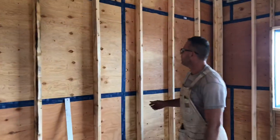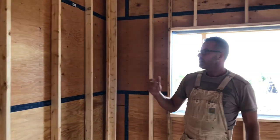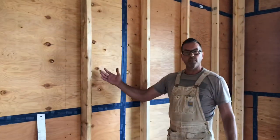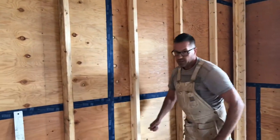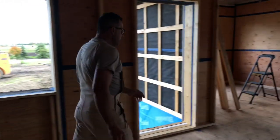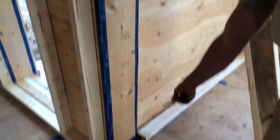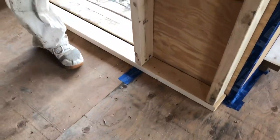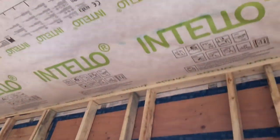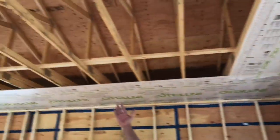Now we're working on our interior cavity wall. This wall does a couple things on this assembly. First, it allows us to run all of our electrical and plumbing without puncturing our air barrier. What we did before we stood this wall was make sure that our wall-to-floor connection was taped — and taped out so we can connect our seams when we go to seal the rest of the floor. We also installed an Intello membrane around the perimeter so we can stand our wall but still leave it open for framing inspection.